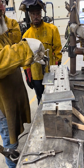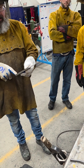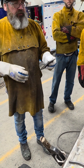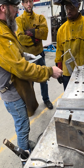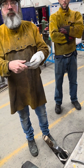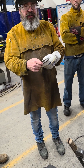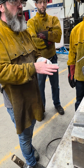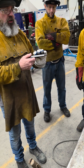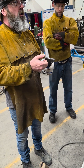I'm going to grind the backside last, and I'm going to grind back about half an inch. One reason I do it last is because you'll see there's dross — that's what people call slag cutting, but it's actually dross. It sticks to the back of the bevel, and your backing strip when you build it won't fit tight. So when I clean this bevel off, I'm also going to put a burr on that edge.